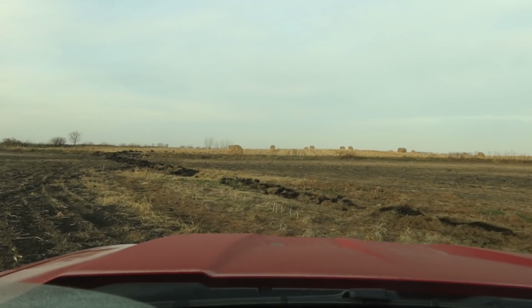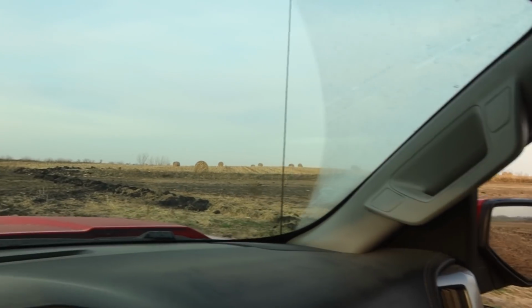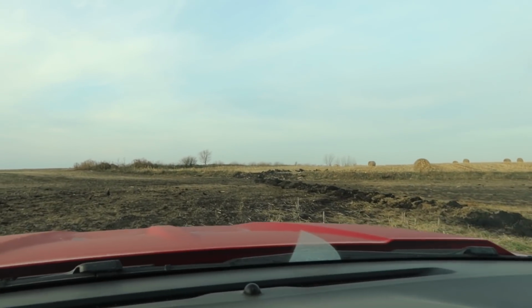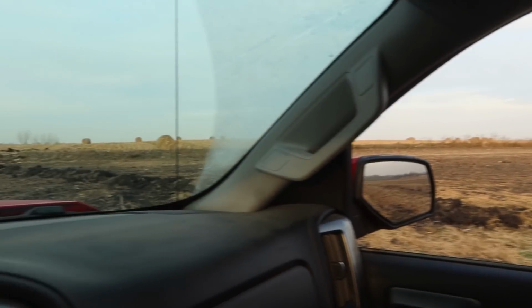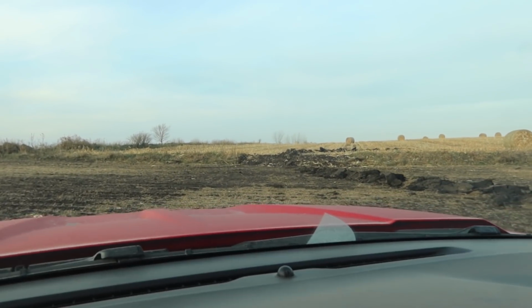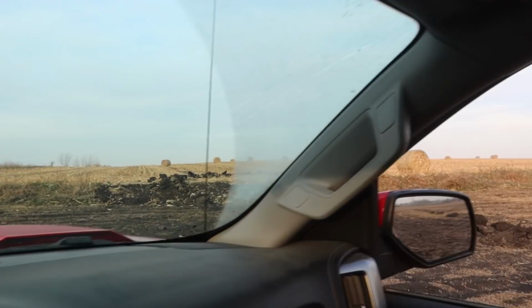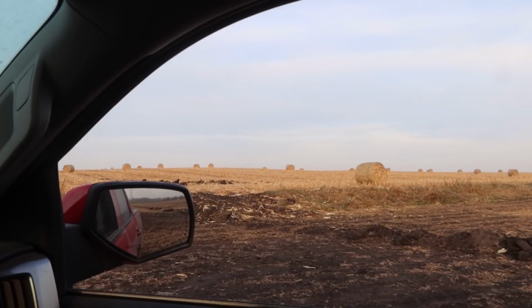We've got another spot here where we're throwing some drain tile in. This is a ditch that kind of comes out of nowhere on sort of a big side hill here. So we're gonna run a pipe underneath it, take it underground. That way it doesn't keep washing the soil out down the hill, so it's gonna prevent some erosion. We snaked it up into the neighbor's field there as well, because we know the water comes from that area.